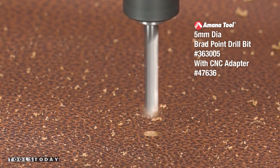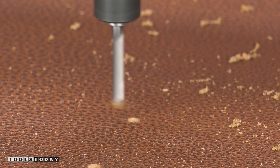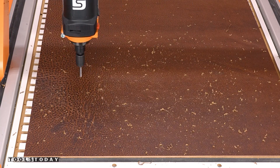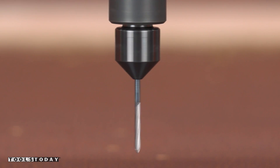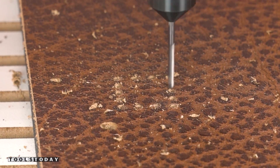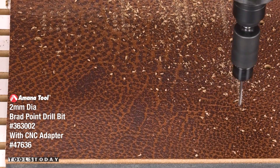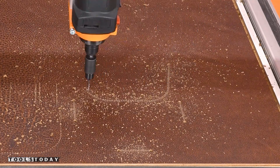I switched out for a 5 millimeter solid carbide drill and set the Z zero to the waste board and began drilling the holes for rivets. After that's done, I'll switch out for a 2 millimeter solid carbide drill bit to drill the stitching holes. Both bits used a couple of adapters to make them work and fit into a quarter inch shank of the machine — those are all listed in the description. It saves a ton of time not having to punch out stitching holes by hand, with 386 of those and 18 holes for rivets.